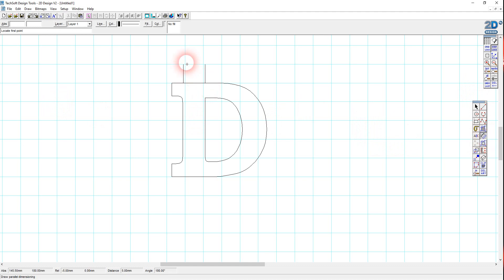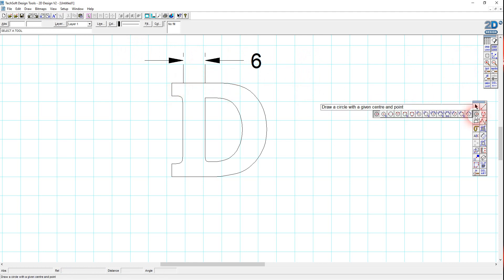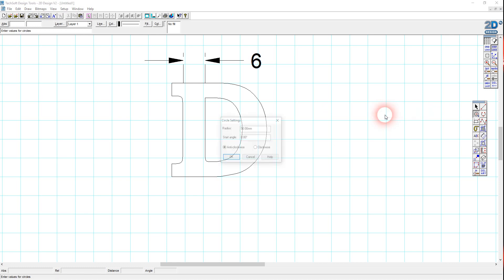Let's come to the Dimension Line tool to check out this dimension — it's 6mm. So I want to have a semi-circle in here. Let's go to the Circle tool — circle with a given center and radius. I'm going to go with a 3mm radius, 6mm diameter circle, and drop it right there so it intersects on the edges with these lines I've identified. That looks nice — this line is intersecting with the edge of the circle and is pretty much in line with the vertical bar of the D. Now I want to have a little cutout in here, so I'll come back to the Circle tool and have a 1.5mm diameter hole placed there.